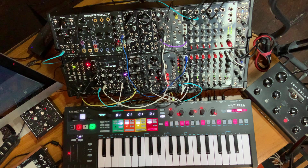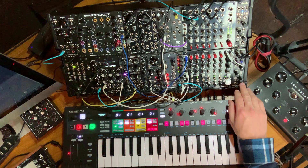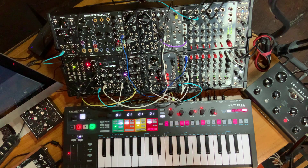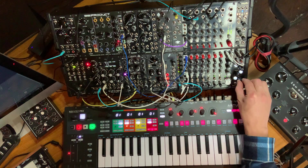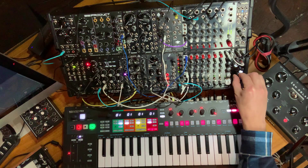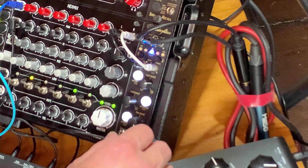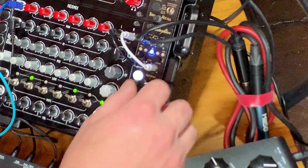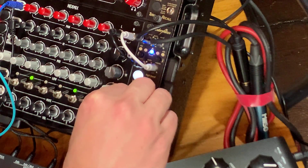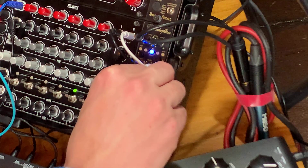This is pretty good. Now let's engage the Golden Master just as I have it set. Right away we hear a bump in volume. Here I can set compression amount per band — you get a little bit more presence that way. Now by pressing the mode switch, I can turn it back to the EQ. I've just dialed down all of the bass — that's a pretty cool performance effect. You can dial down the high too, and we can have a section where all we hear is the mids. Bring back the highs, bring back the bass, give it a little boost, make it a little bassier.